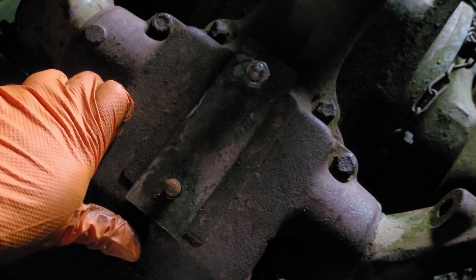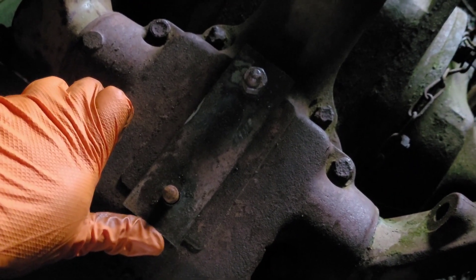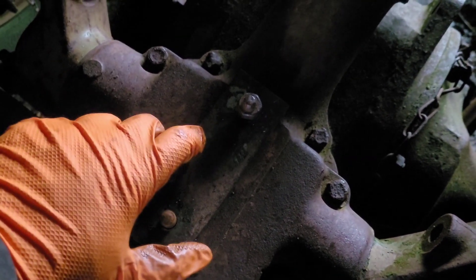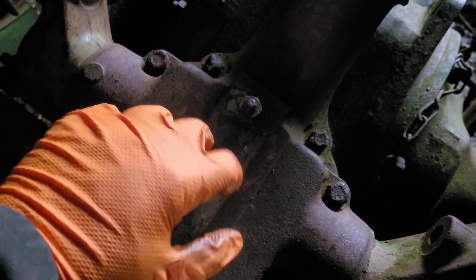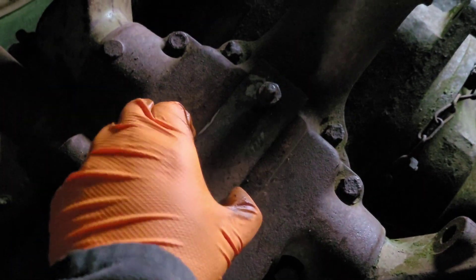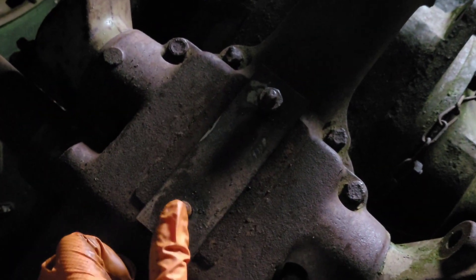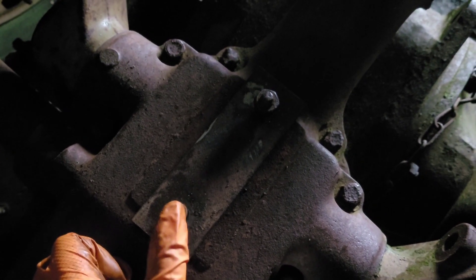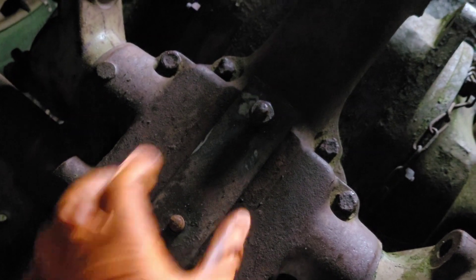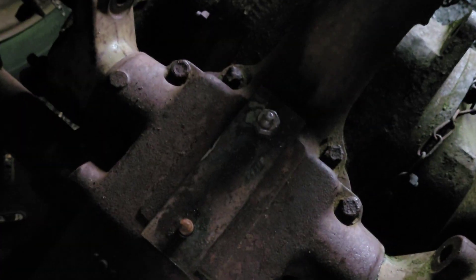I used the rest of the steel I was using for the leg bracket to make a bracket for the seat. It's two inch — I'm going to put inch and a half box on it, so there's a nice bit of space to weld on. The holes are actually 7/16ths I think, so I've gone up to 12mm so we have a bit of give in them.